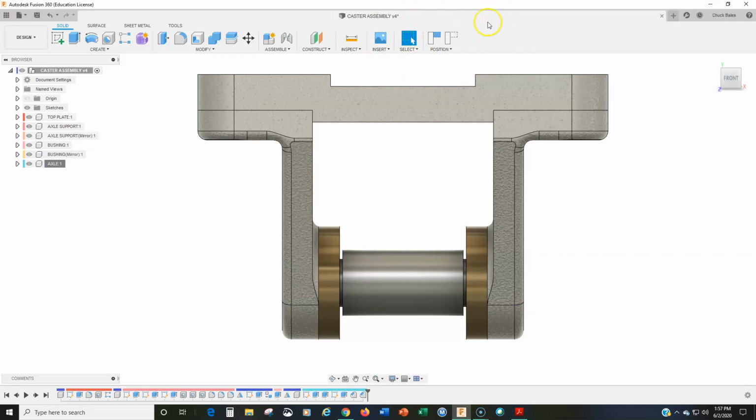Now up here, notice that this is kind of like a check. It's saying, hey, did you really intend to move it like that? Do you want to keep it right there? If you don't, then you can send it back. Sometimes you want to move something just to see how it interferes, to see whether there's room or how it's going to fit, but then you ultimately want it to go back. So this revert is kind of like the undo command for the move or copy. Of course, we want to capture the position, so we're going to capture that there. Okay. So our timeline is good, right?